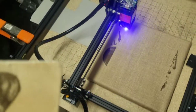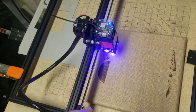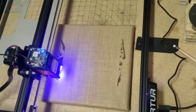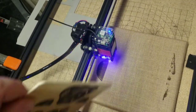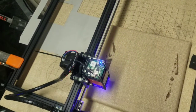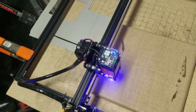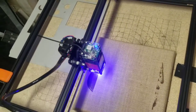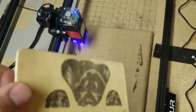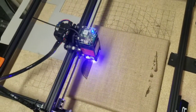If you're trying this at home and it starts stuttering, especially burning image quality with a lot of data to buffer, at higher speeds it might just take a little longer and makes the stepper motor stutter a bit. It's been happening to me quite regularly — I just expect it now. It doesn't seem to affect the quality of the work while it's stuttering; it just goes a little slower but will buffer out and start running smooth after about 30 seconds.